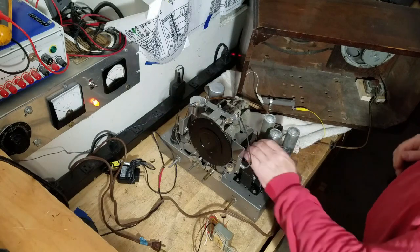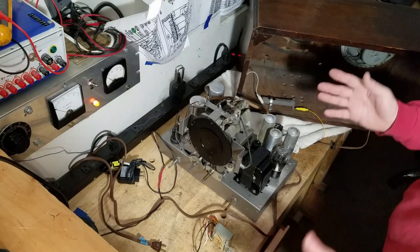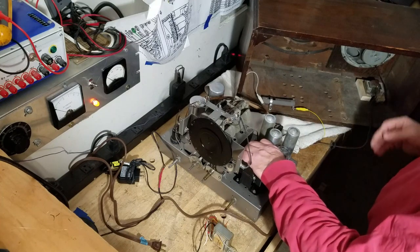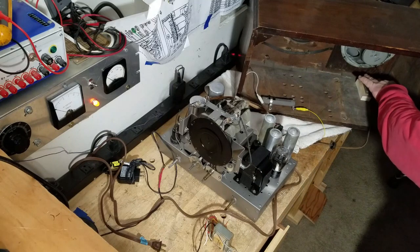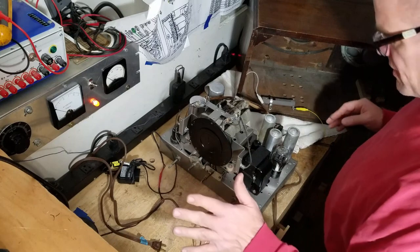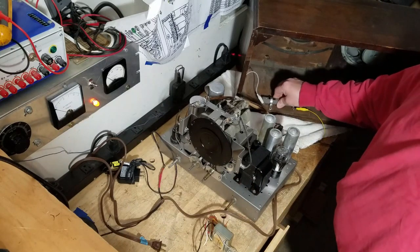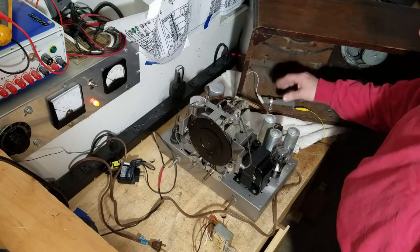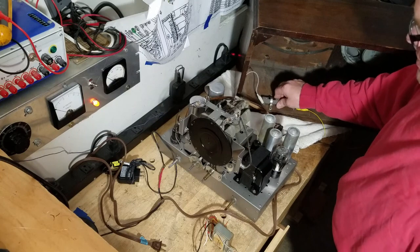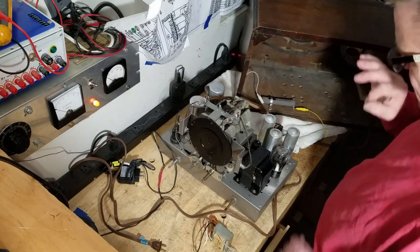Now, let me check the temperature. Ooh, that rectifier's always hot, guys. Just to let you know. But the transformer is icy cold. Perfect. Let me just touch this output transformer. Nope, it's not hot. Let's see, it's unplugged. All right, so I can touch this. That resistor's only a hint of warm. Now, I haven't been playing it for long, but I think I sized everything just right. This resistor is just barely a hint of warm. I think this is going to work out fantastic, man.